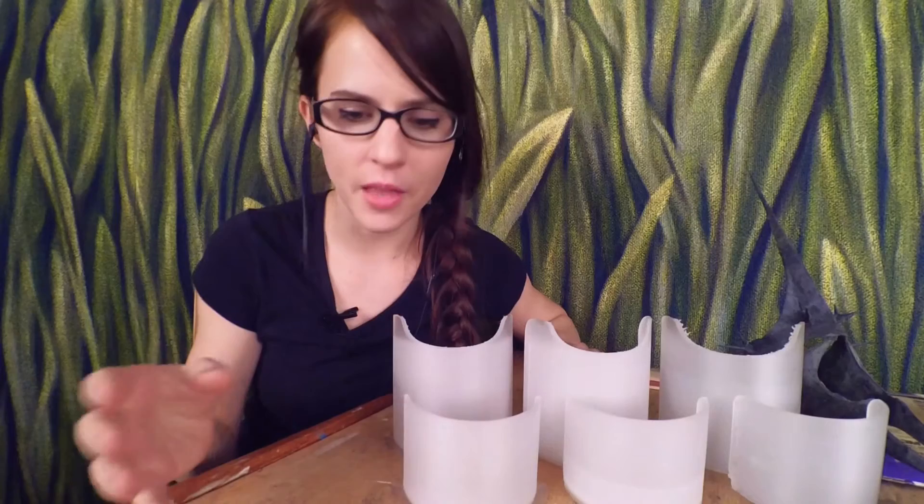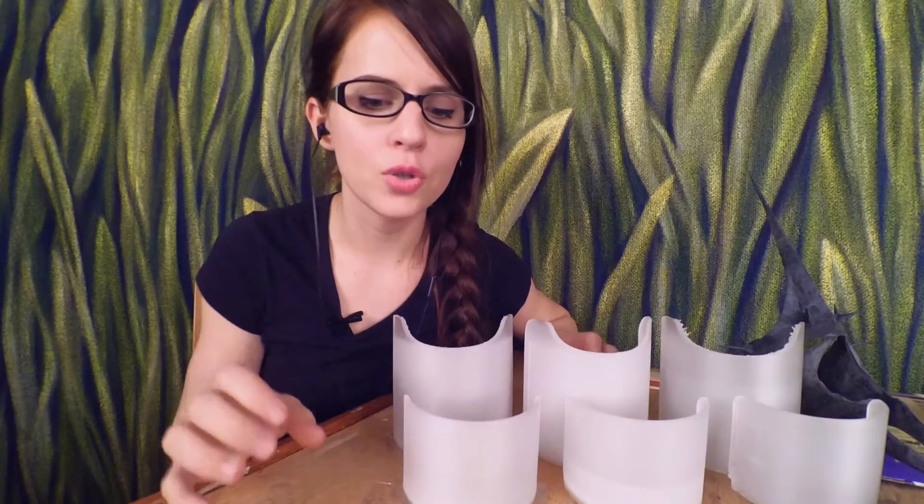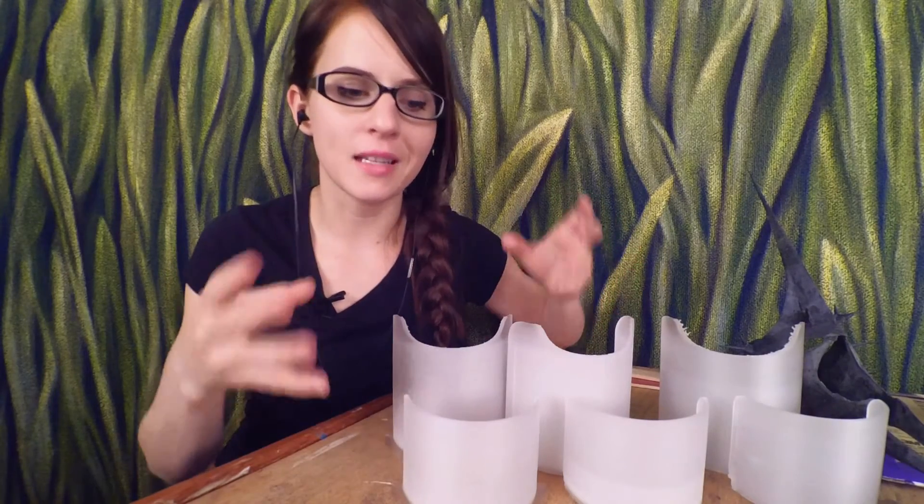If you are printing something that is square in a single spiralized wall, then by all means do the tiny spiralized square. But if you're printing something that's curved with a certain wall thickness, or whatever those general specifications are, then choose or create a small test print that offers those same challenges and gives you a better representation of what the settings do with that filament in that type of pattern.